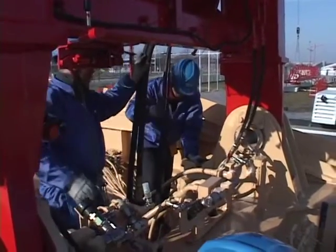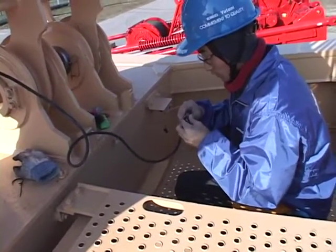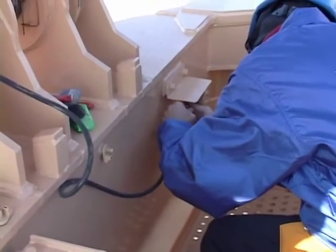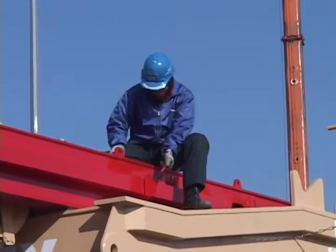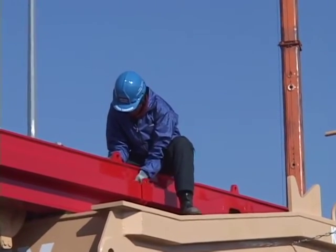Connect the hydraulic hose and cables for the W1 hoist winch. Be sure there's no water inside, since this can cause damage. Remove the guy-line link fixing pins on the left and right sides of the mast and stow them.